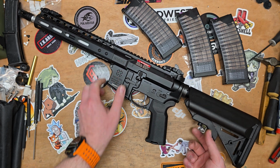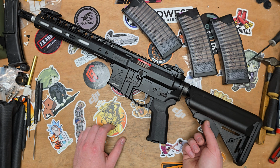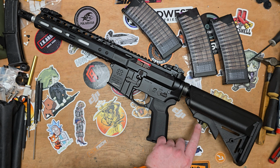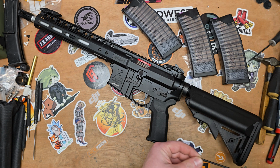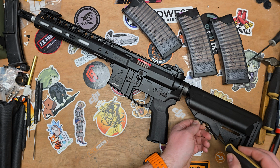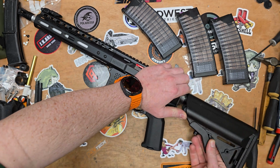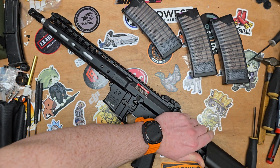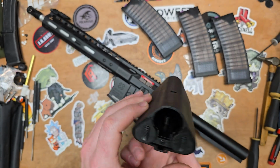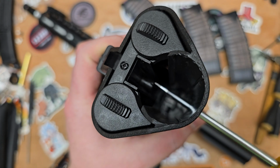And I think it's a simple thing. It's when the stock's been put together at the factory. With these sort of Crane stocks, what you can see sometimes is where the lever's a little bit loose, and you've got a tiny little Allen key there, which I think might be a 1.5. What you can usually do is back the grub screw out, and when it's been assembled from factory, these just haven't been wound in. Now you'll see I'm turning it, but it's not actually turning on the stock itself. It's not adjusting. So if we pull this stock off by pulling this lever down, they usually have a hole in the top. And we can slot in a flathead screwdriver. There's a little slot that you'll see on that piece there.